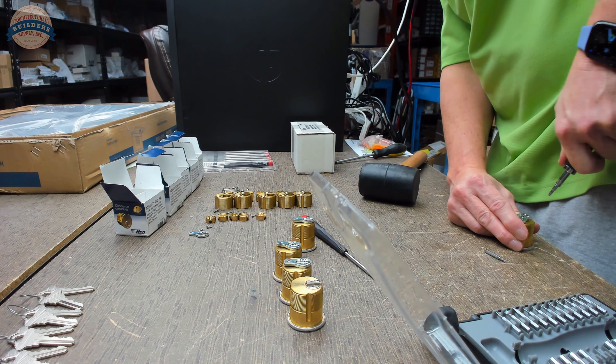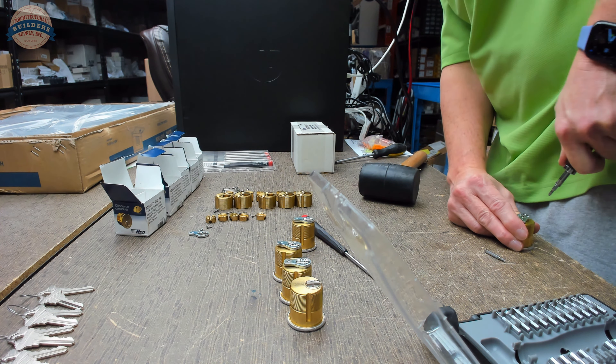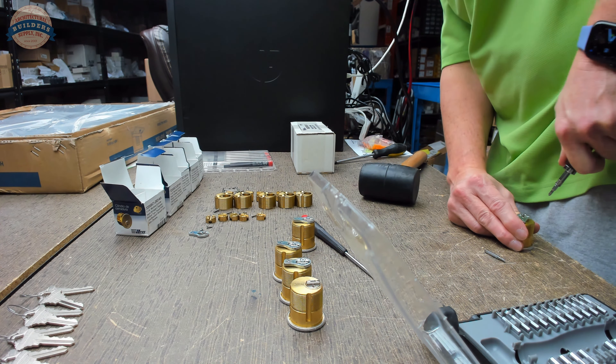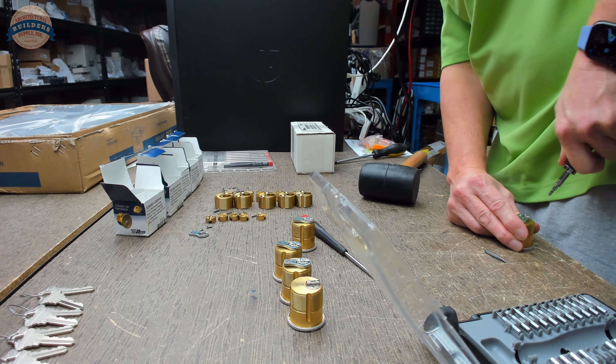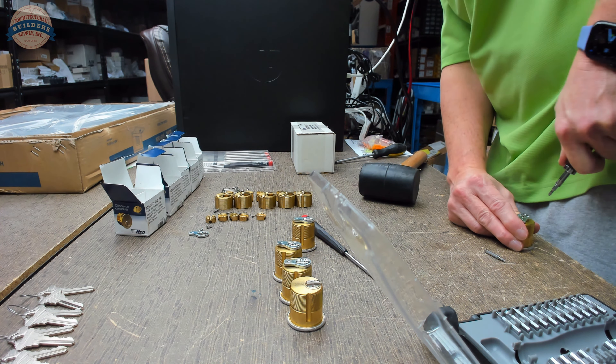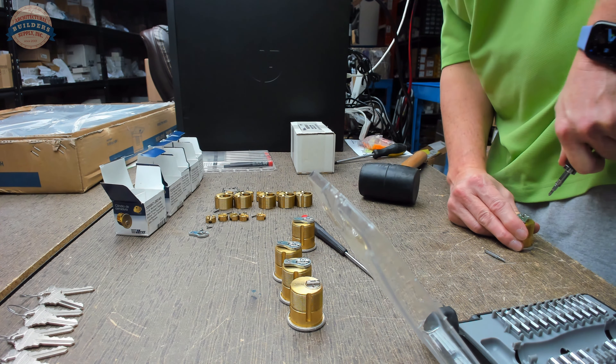You don't want an inverted top cap because it's a natural and obvious way for water to come into the door. If you ever notice a door that's rusted, it's always rusted at the bottom. Now if you had a 7'0" D door, Kewanee's hinge locations were equidistant from either end. However, the lock location is not in the right dimension — so because you have a beveled-edge door, you can't flip that over end for end. There's just no way to do it.